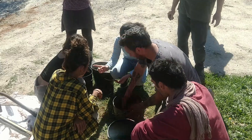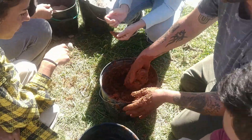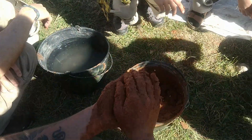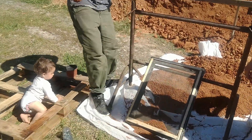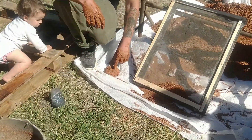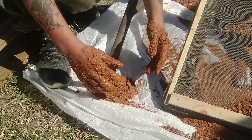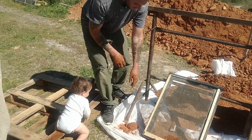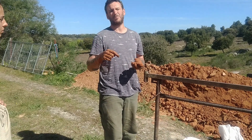There is the ball test: you make a ball and take it to a flat surface. From around waist height, you drop the ball. If there was too much sand it would start to crack at the sides. If it was too much clay or too wet, it would just spread out flat. But if it holds its shape, that's quite nice. A little bit of crack is okay. That result suggests maybe going slightly over one-to-one sand — more sand than clay.